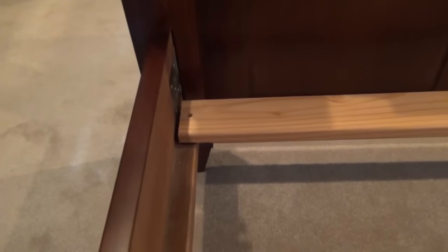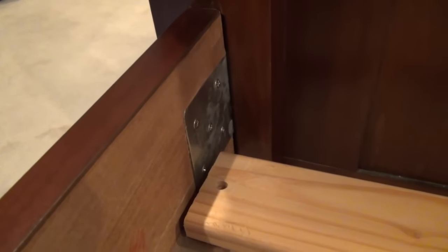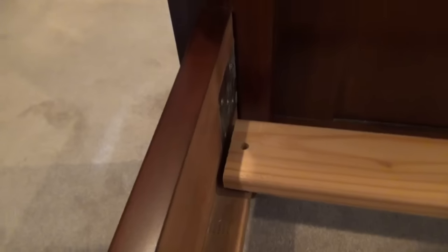This is a king-size bed and moving the mattress around isn't any fun, so I only want to do this job once. What I'm going to do is break apart the frame — these are just brackets that fit into a mortise on the post and they just pop right out. If you have a different type of bed frame with nuts and bolts, more than likely all you have to do is tighten the nuts or bolts and that should solve your problem, and you can even lubricate them with WD-40.